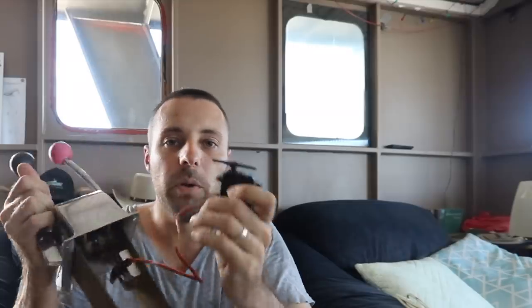Now, this is built with radio controlled car parts, so a lot of people would be nervous about having that sort of thing on the boat like this. The way that we were going to do that is build in between 2 and 4 layers of redundancy. So we were going to have 2 duplicate systems running at any one time. So if the first died, automatically the second one's already running. So an alarm would go, so we know that system one is down, but system two is already taking over. So there was essentially no way that the system could die.